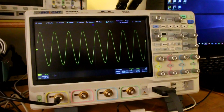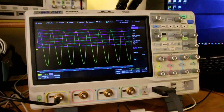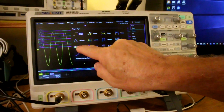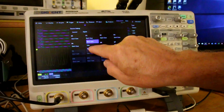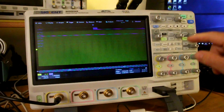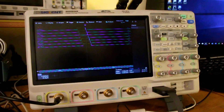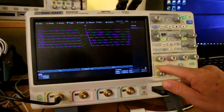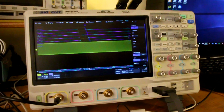There's an optional 16 digital channels that you can get. I've connected them here and they're sampling some data from a little microcontroller board I put together. I can turn on the digital channels as easily as doing this — and you can see them there. The data is all kind of scrambled because we're not triggering on anything. If I go to this pattern trigger, I can set that up and specify what source I want — let's say D1, data bit 1, being high. I'll clear that out of the way and turn off the analog. All mixed signal scopes have this feature, and the really important thing about a mixed signal scope is that you can look at both the analog and the digital at the same time to see how they interreact. You can trigger on either the digital or the analog channels.